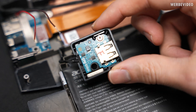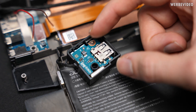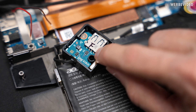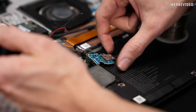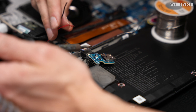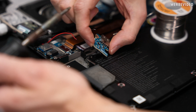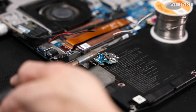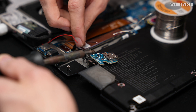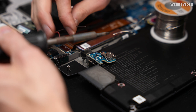I've already opened this special additional USB sitting inside the notebook. The outer one is ground, or even the case is ground — you can probably use the case, which should be a lot easier. The pin right here in front of my finger should be 5V, which is probably the easiest source for our pump. I know a lot of people will hate on my good old soldering iron, but I always say: use the tip as big as possible and as small as necessary. A smaller tip won't make your result better — it will just make soldering harder because it stores less energy. Just use a bigger tip. Makes things a lot easier.